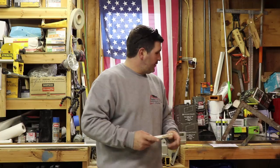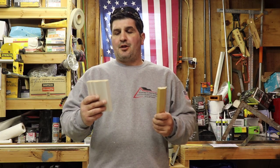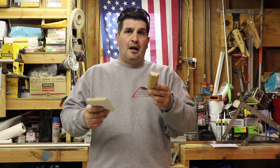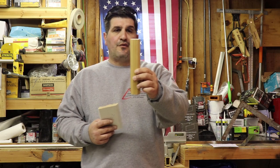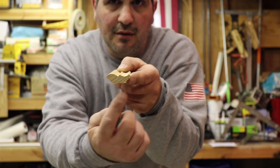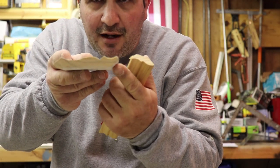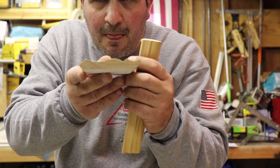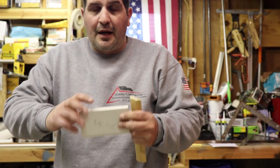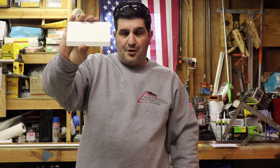Right off the bat, the two most common types of crown are 38-52 angle or 45-45 angle. I didn't have a real crown molding with 45 - this is a cove molding - but you can see how both angles are even. Now if you look at this one closely, see how this angle versus this angle is a little different. This one is a 38-52, this is a 45-45.